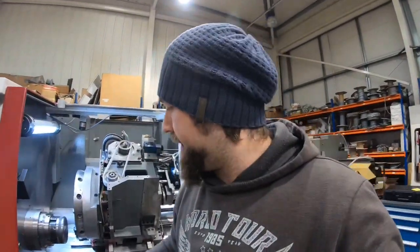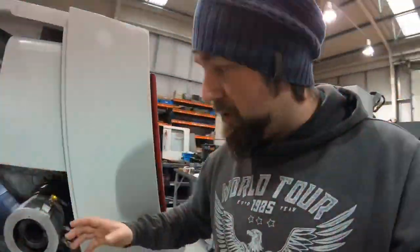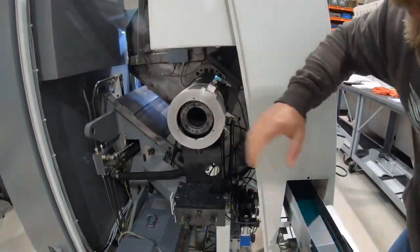We're stopping in the program and I can't get to the end of the cycle. We've got a fault — collet opening. It actually physically opens. I'm losing the proximity switch signal, so at the minute we're clamped. I've also checked the input for that and when we unclamp we'll move that.